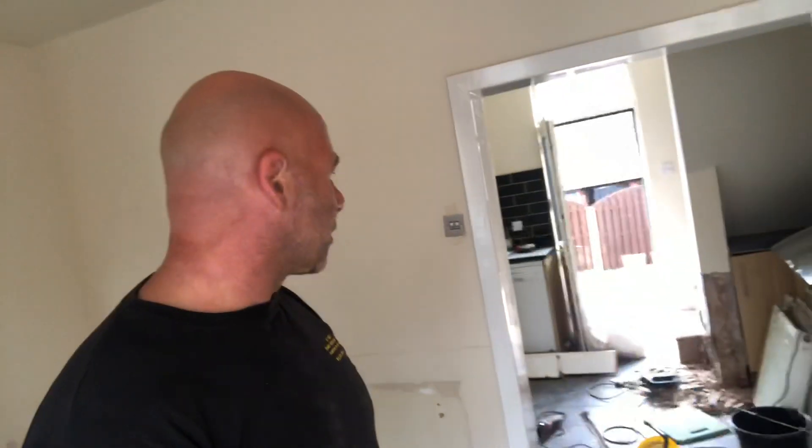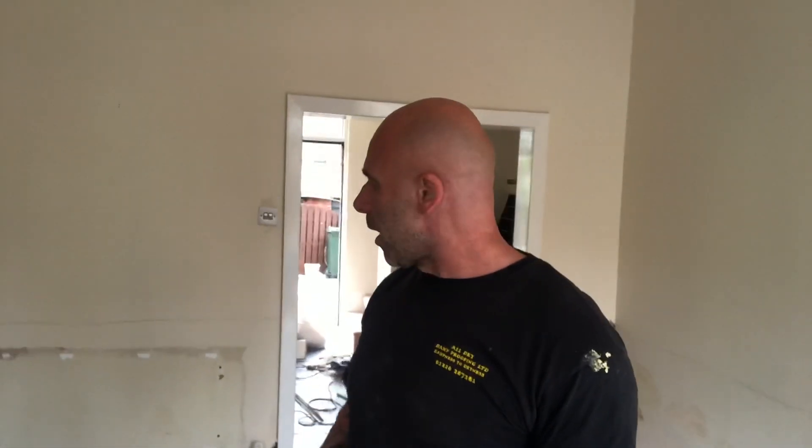It's just guidelines we've been told. So that's a Friday job for you. We're doing a whole room and it's not a bad job because we like them when they're empty — it's better than having furniture in. I'll probably show you in another video once we've got the backing on. I've got to make my mind up yet, but it might be a hybrid system — a fast system on some walls, but I think I'm going to use Render Light. So it'll be about a day hacking off, a day fixing the backing on or replastering the backing system, and then a day after skimming.